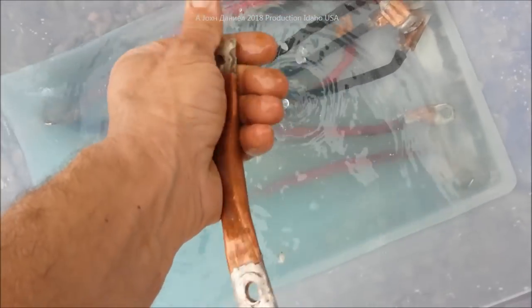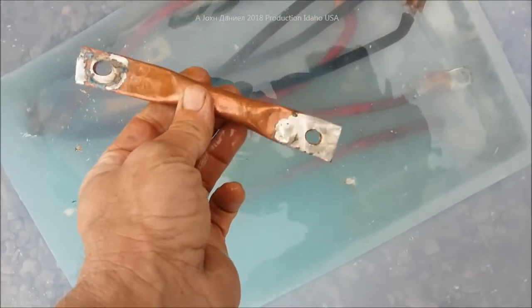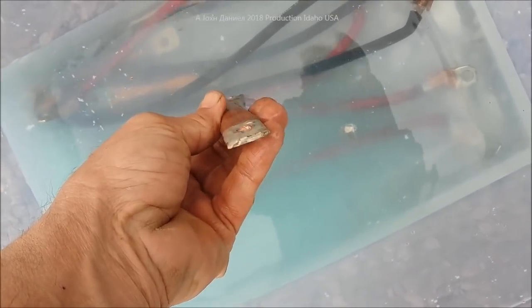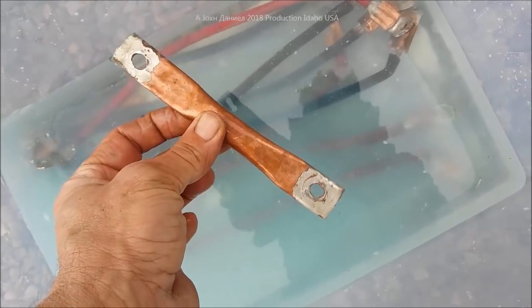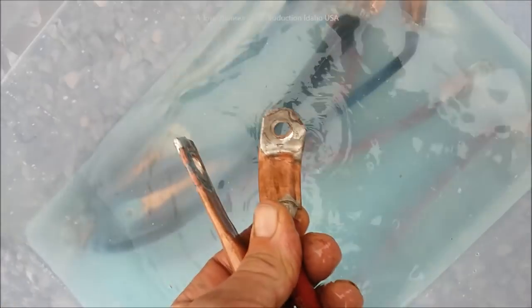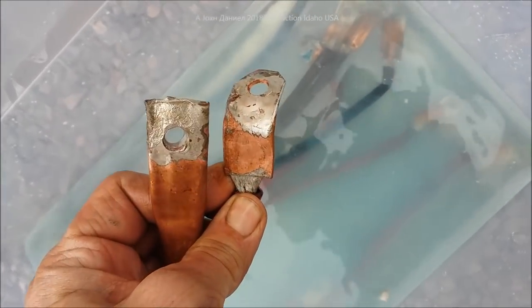In my case, these were my first-ever made battery jumpers for six-volt batteries. To connect them it's just using half-inch soft copper, and it's capable of about 950 amps, so don't worry. If you take silver solder, flux them a little bit, and tin them, you have really nice terminals for hooking up your batteries — they handle it all.